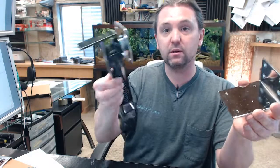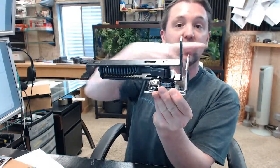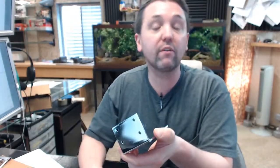The jam bracket installation, which we're going to talk more about in a moment, gets screwed down to that, and then this gets attached to the wood frame or whatever the frame would be made of. That would be for an installation where you are not in a position or able to drill into the floor, for whatever reason. You might have a concrete floor and you're not going to drill into it, but you've got a wood frame and you will drill into that. So that would be a scenario.